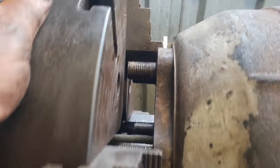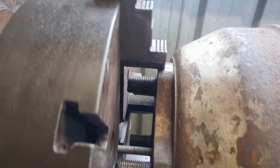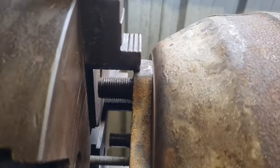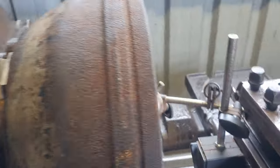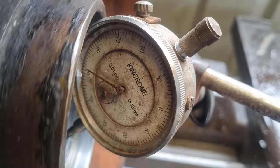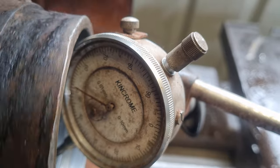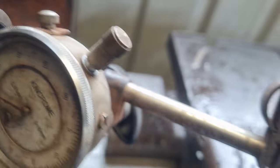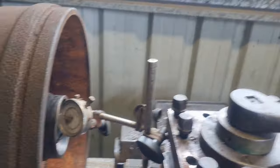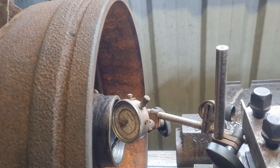Okie dokie, this took a bit of fluffing about. I've got two spacers in there, two in there. That gap looks a lot more even, all the studs are away from the face of the chuck, and I've trued it up off the bearing. We've got about 0.01mm of runout. If you can feel that in your brake pedal, I'll be impressed. Now just out of curiosity, I am going to put the dial gauge on the actual drum and see how much runout is on the drum.